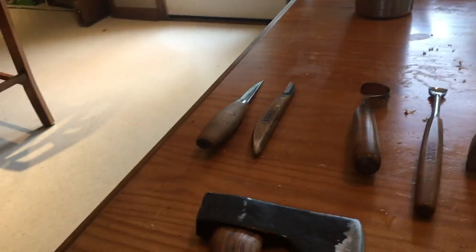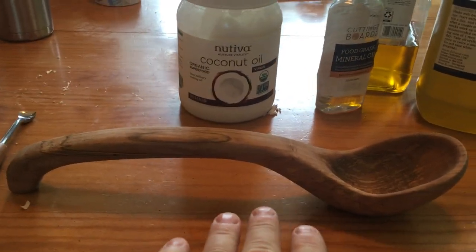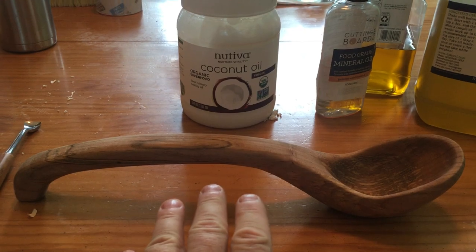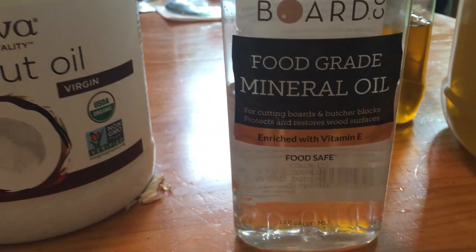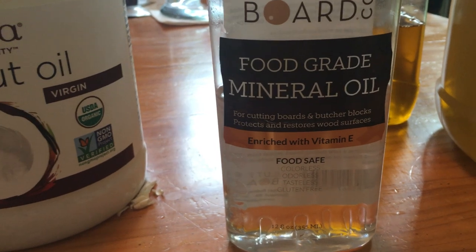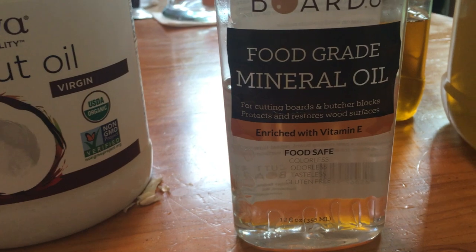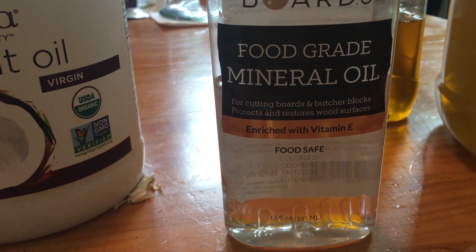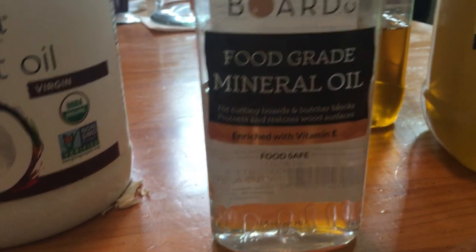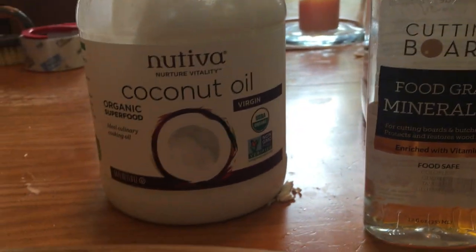When I finished with the large spoon — that's maple — I treated it with food grade mineral oil. That's fine, but here's the thing I've found out about food grade mineral oil: you have to replenish it. It is not a permanent thing. You don't seal it and you're done — you always have to keep applying it. So probably not the best choice.